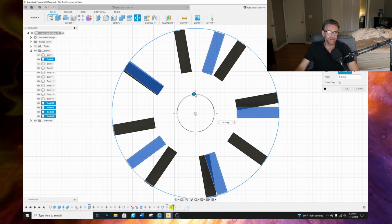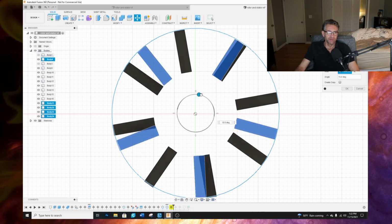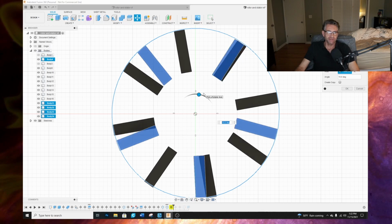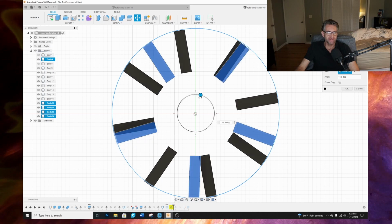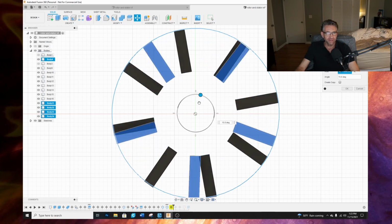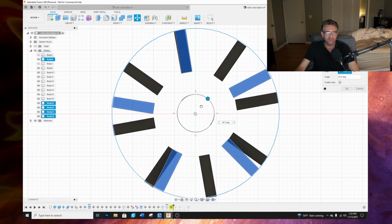And if we were to rotate this, and we're looking at this one magnet up here, right? It's gonna have a lot of resistance right here, just for that one magnet. And it'll reach a point, like right in this area here, where it sort of zeroes out. It sort of balances, but it's an unstable position. It's gonna want to go one way or the other. But the thing is that this resistance gets to a point where it zeroes out, and then it wants to push, right? Well, that resistance right here equals the same amount of force pushing it. So it just sort of balances out.